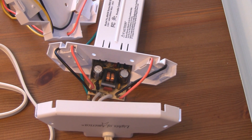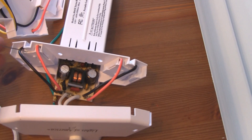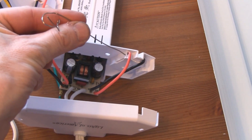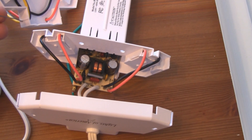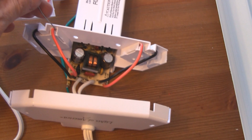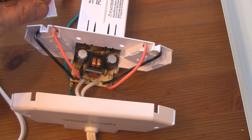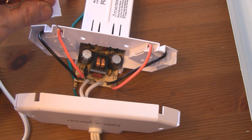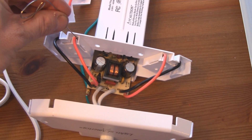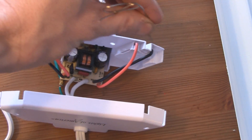Now we're going to take the red wire and the black wire from one side and combine them with the black wire and the red wire from the other side. These wires are locked in there, but if you push a piece of stiff wire — or a finishing nail — down into the slot and yank on the wire, it'll pop right out.